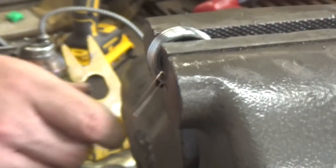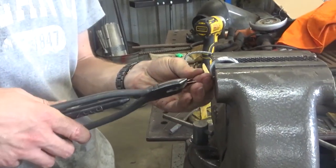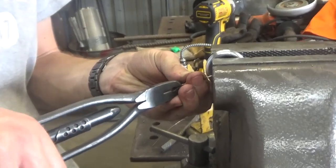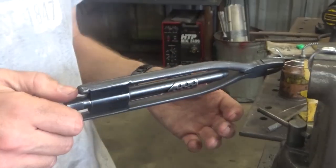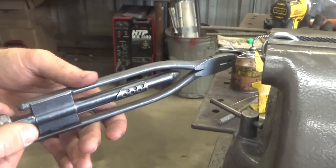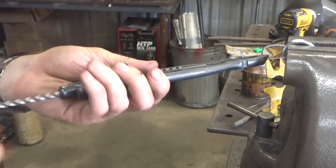So all we do is get this going — this is one of a bazillion uses — and we come in here and use these pliers. I'll just make sure the pliers are grabbing on both sides, then use this lever to lock the pliers closed. This is the really cool part: when I pull on this knob here, that wire tying action happens.